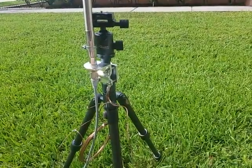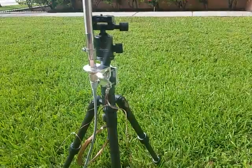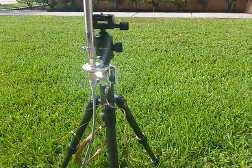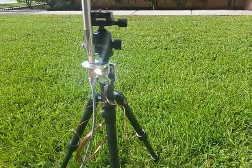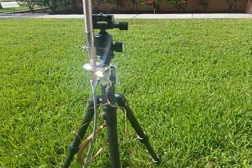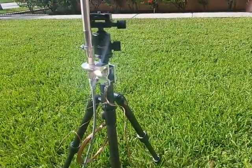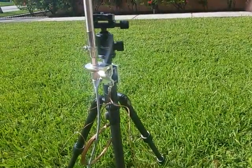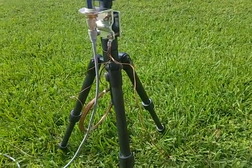It's not as wide as you might think — this is a very portable field antenna. From my experience it's quite a capable antenna. A quarter-wave vertical is a quarter-wave vertical electrically, so regardless of whether it's a $50 telescopic whip or a $500 piece of equipment, from an electrical point of view it really boils down to the same antenna. A big difference of course will be your radial system.